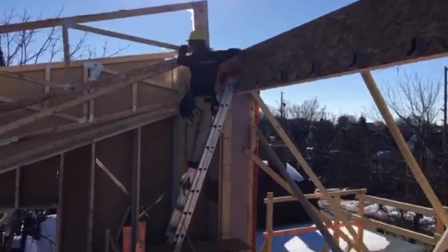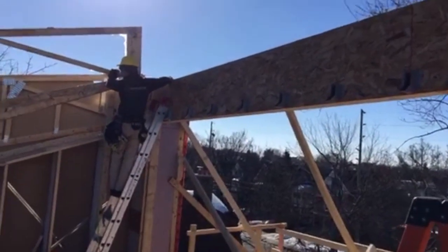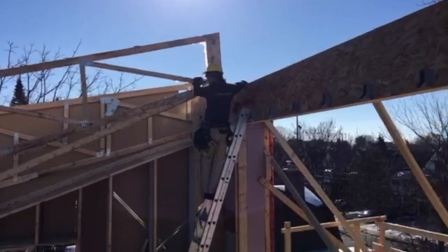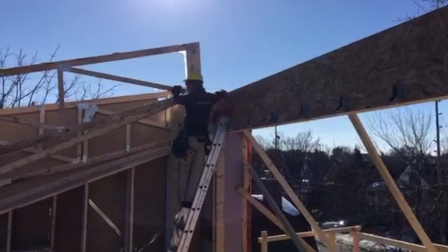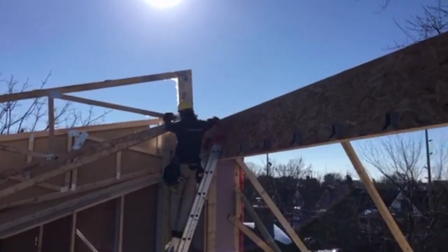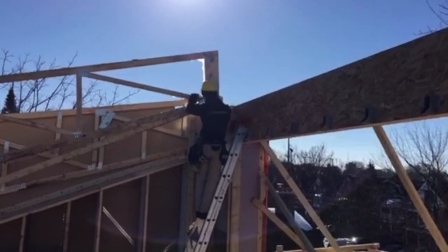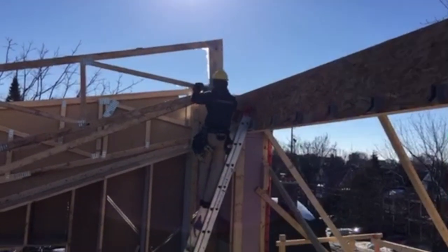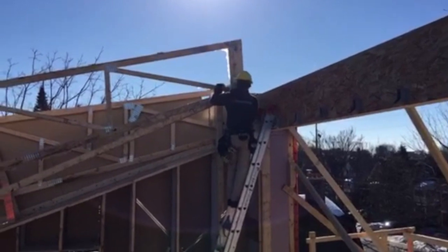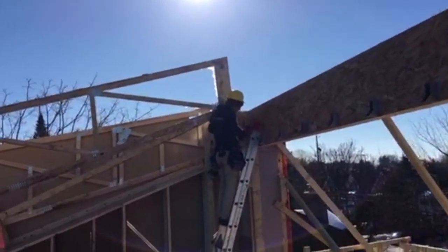You know what happened? We don't have that close spaced one that was in the drawings. But we're going to be building, we can go to the next hanger. As long as the next hanger is 24 from that wall, we can go to the next hanger, because we're going to be building up that wall anyway, and that would cover that span. Yep. So Mark, we're going to go to the one behind you. Okay, that's 48 from the outside. Yeah. Is it 24 from the wall? It's 48 inches from the outside, so that other cavity would be 24. Yep. So it's going to be a bit more than 24.